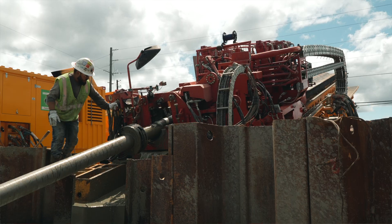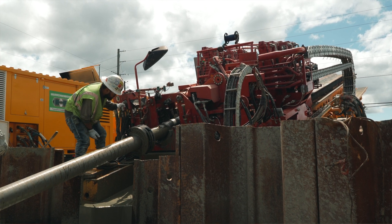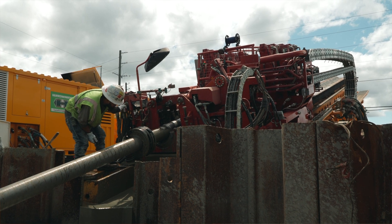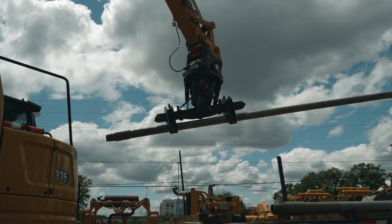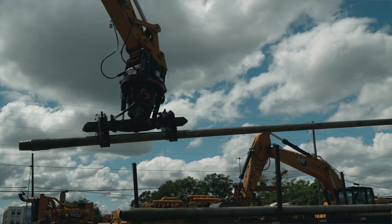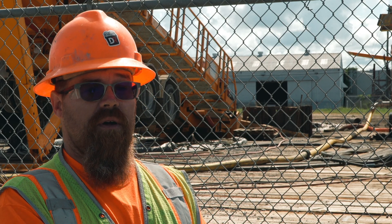In traditional mud, you're going to mix your gel, your polymers, your soda ash and all this stuff independently. As it mixes, you want to keep a close eye on it because water-based mud, when you let it sit, it starts to separate. When we stop to make a connection or we stop the pits for the night and come back in and go to fire them up, SureFlow — it looks like you've destroyed the system. But the second you go to work in it, it's almost instantaneous how little shear force it takes to get the mud looking right again.